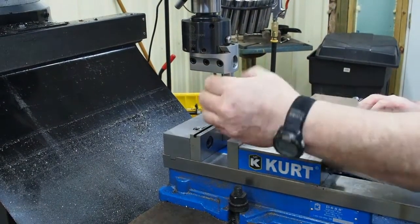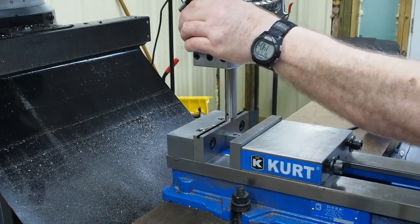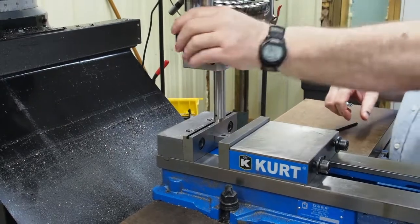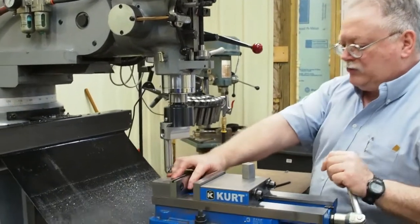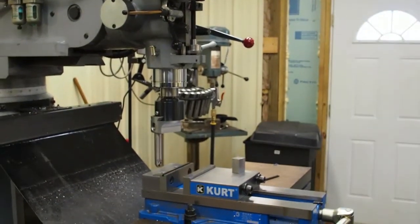I can feel the drag on the tip of the boring bar, and that's with pivoting it slightly and finding the high point. That paper is roughly about four thousandths of an inch. I'm going to leave it that way because when I grind this I want to have a one-inch radius, so this way it'll leave my radius just the right size.